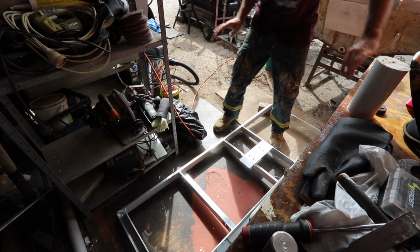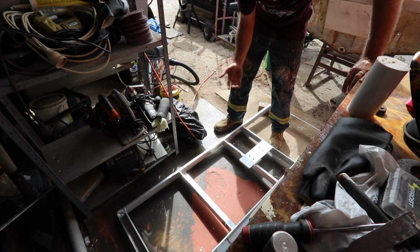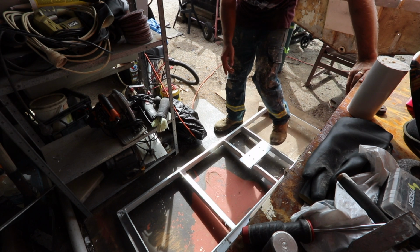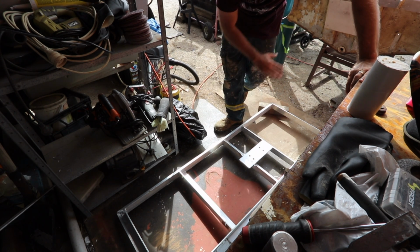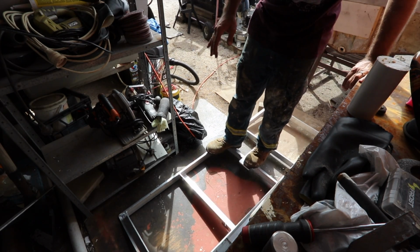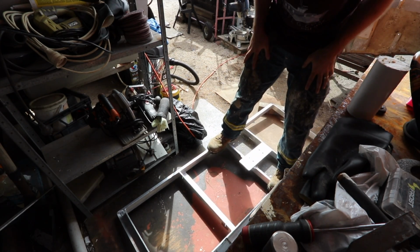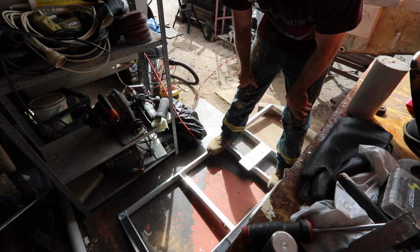Alright, so we're set up on the floor. I have to because my welder won't allow me to weld it at a height. It's a long story, but the aluminium wire doesn't like it. So I've got a block in that corner and a block in that corner, the whole thing's off the floor, and I'm going to basically stand kind of like that when I weld it. I weld these two up, and hopefully we'll get a bit of twist by doing that.